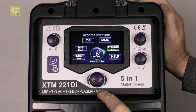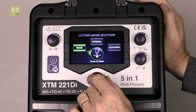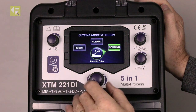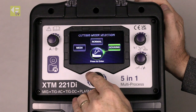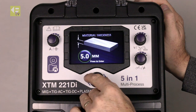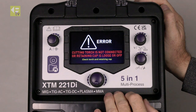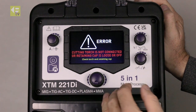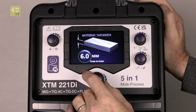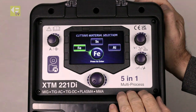Plasma — this is the additional process with this 5-in-1 machine: plasma cutting. I can do mesh cutting for mesh and grid, normal, and gouging for creating weld prep or back gouging plate. If I say normal, I select what material I'm going to cut and dial in the thickness. Now I've got an error here because I've no torch plugged in — the machine is really smart, it detects I haven't got my torch plugged in. But that's an indication of how easy it is to set — just dial in the thickness and the machine presets everything for us. So that's all the processes, easily set up.